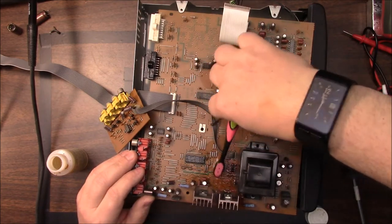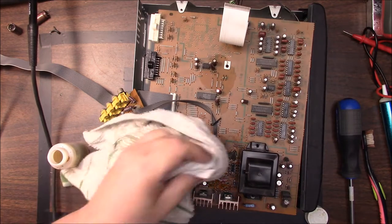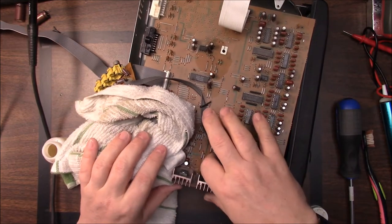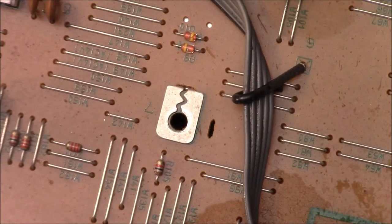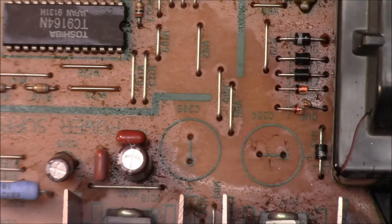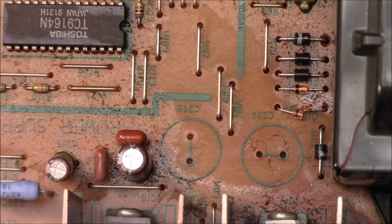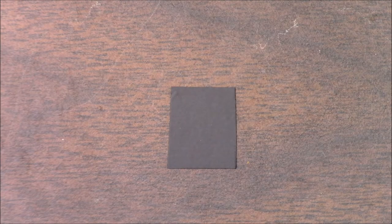We are coming right off that regulator over there. There — a bad diode right there! Whatever happened shattered the diode right there. You look right there — it must have shorted out and busted it. So we're going to have to replace that. Unfortunately I don't know the number, but we will endeavor to find out. I may need to pull a schematic up on this, but right now let's put this aside and check our capacitors.